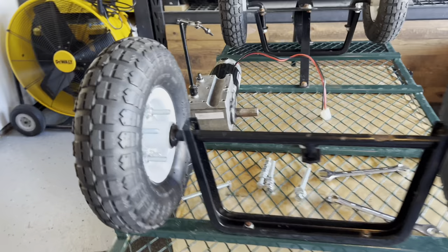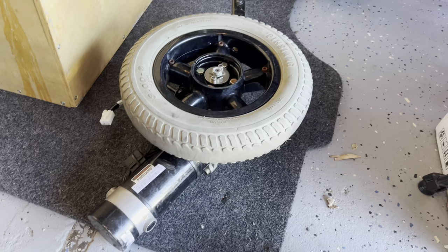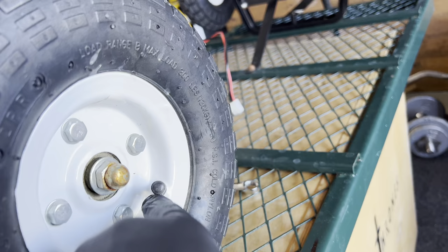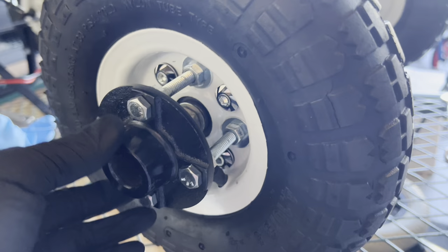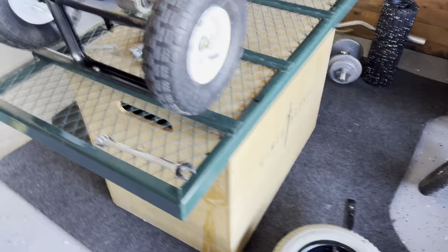So I just showed you the motor on one side of the wheel. Now I'm going to go ahead and show you how I did it so you can see — I'm actually using a motor from a wheelchair. We're gonna attach it here. What I'm gonna do is have four screws that correspond right into the middle of these, mark them, drill through, and mount these bolts on. This spindle thing — I'm not sure what it's called, but it's part of the wheelchair. Quite easy to do actually, so let's go ahead and do it.